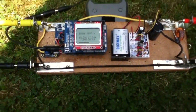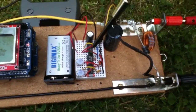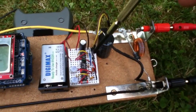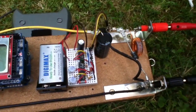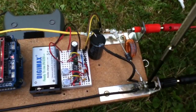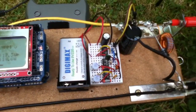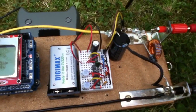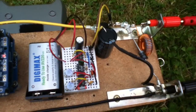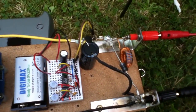So that's the current state of play with the MPPT solar test rig. I've been having some thoughts about what's going on with the buck converter and the oscillator. It seems to me that the next phase is going to have to have a proper microcontroller-controlled oscillator because this one just doesn't have enough flexibility. I'm going to have to reference the microcontroller to the main ground line that everything else is referenced to. Currently the oscillator has its ground up here so that I can drive the MOSFET easily — high-side MOSFETs are notoriously difficult to drive. I might use opto-isolators, and I'm certainly going to have to put a charge pump circuit on here to get a voltage higher than that of the battery.